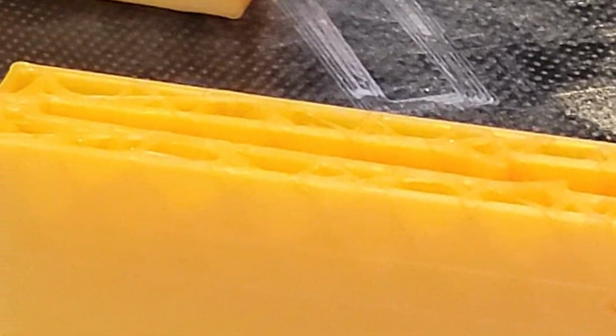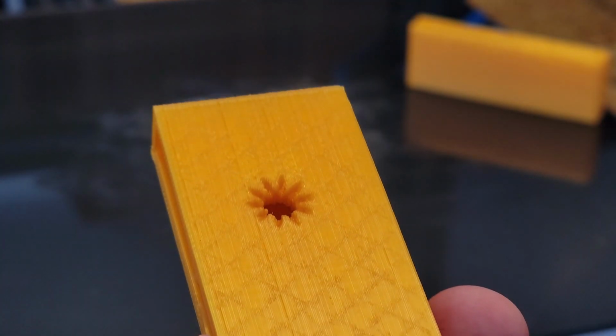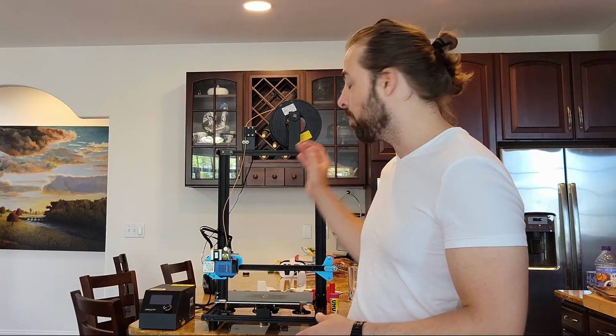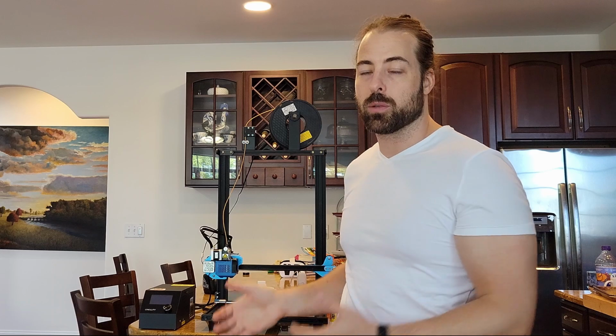After a few hours, which turned into 2 days, is the Creality CR10 version 3 worth the fix? Yes. No. Yes. Nah. So, using the least favorite filament that I had, I was able to level out this heating block that I had bought from Creality. It came pre-made, pre-assembled from the factory, and I didn't check it. And that's what the problem ended up being, was the nozzle was offset. It was off to the side a little bit, and the heating block I noticed was not perfectly level. So that's what I did, that's what I showed you.